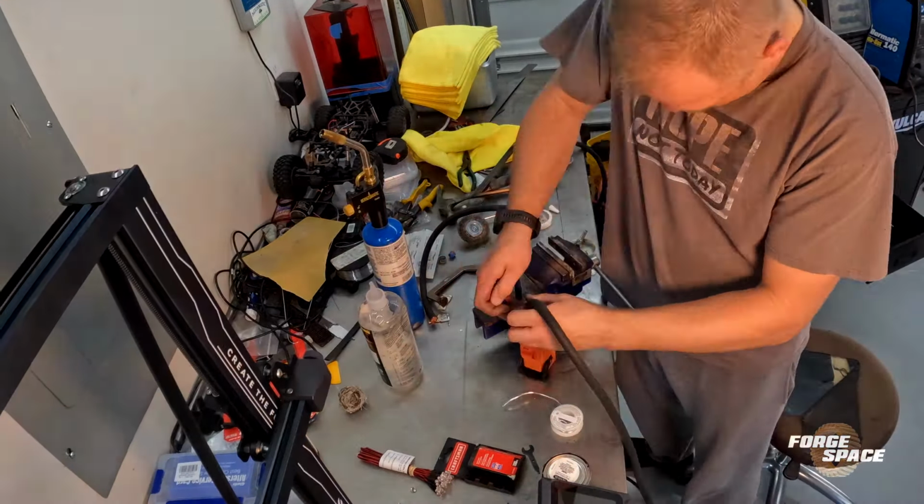So this guy is all positioned in right now. A little bit of a gap here and there, just because the fiberglass on the bottom side is not even. So all I'm going to do is mix up some potting compound, which is just epoxy with some milled fiberglass. And then we'll paste it on there, Cleco it down, and then let it set up.